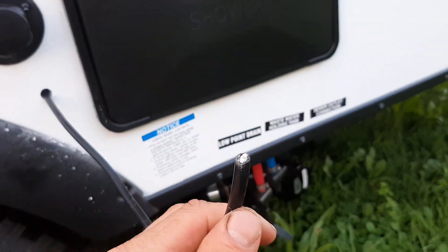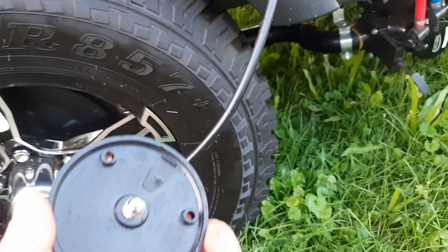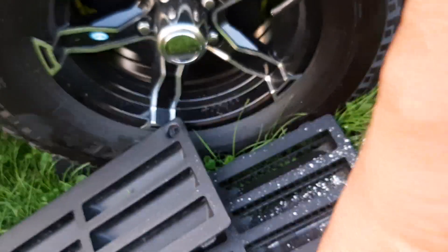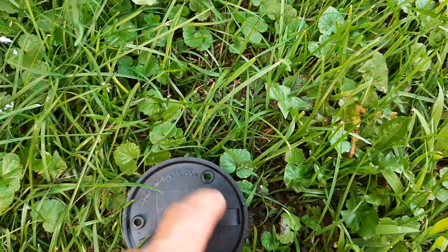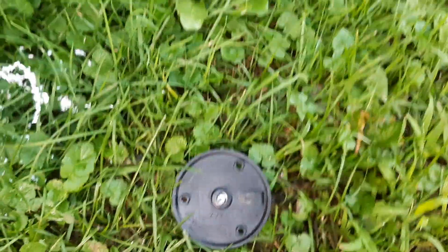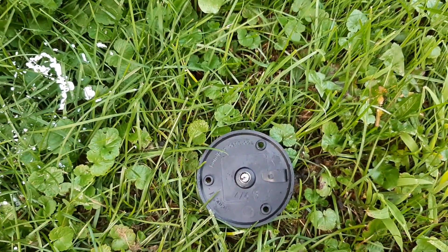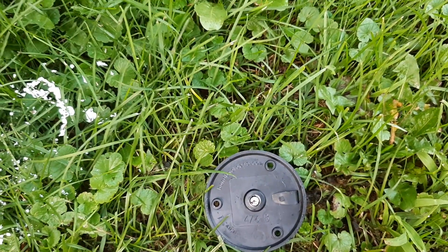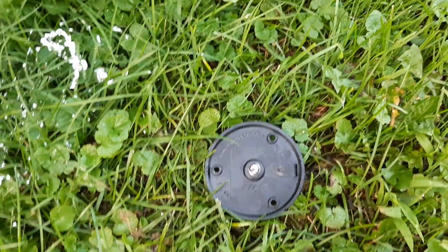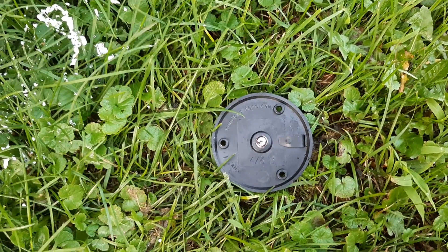Here is the cable TV wire outside — all we've got to do is put a connector on there and screw the connector onto this adapter. You don't want to seal around where that connector is, but you are going to want to add some sealant where each one of these holes goes through the side of the unit to keep water out.